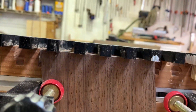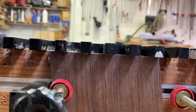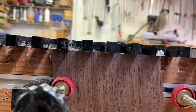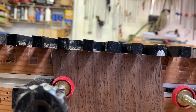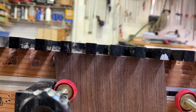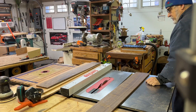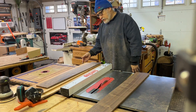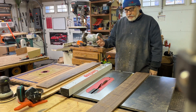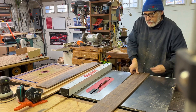I've already put a 10-degree angle on this particular board, so I'm really matching the board to the width of this particular dovetail fixture. From here I've got to trim these all to width. I'm going to be trying to do two of these at the same time — might as well keep the setups the same. Putting the dust collection on, now the table saw's on.